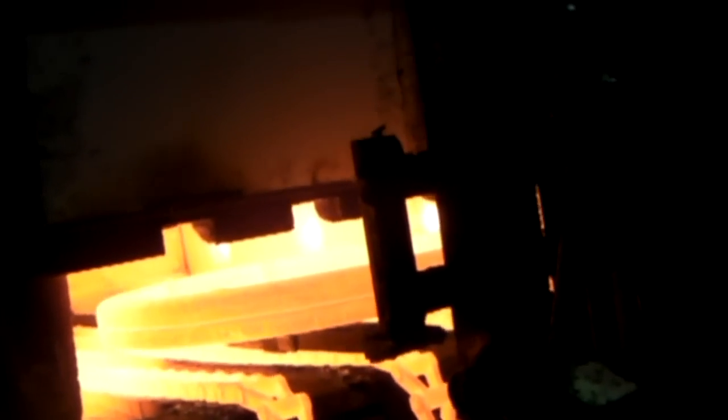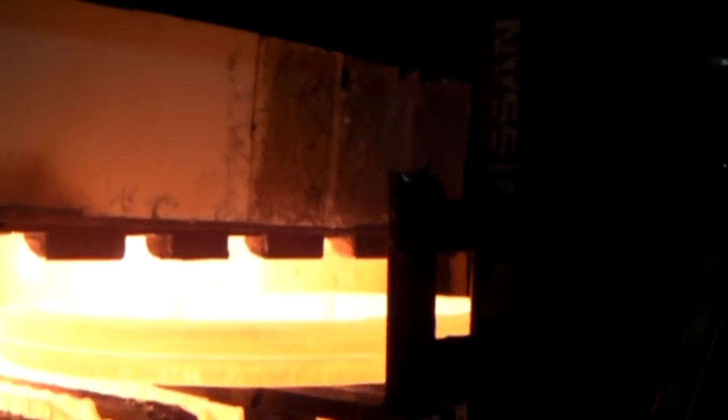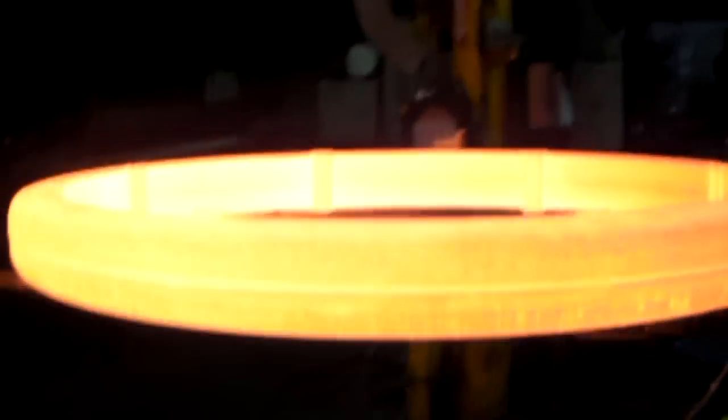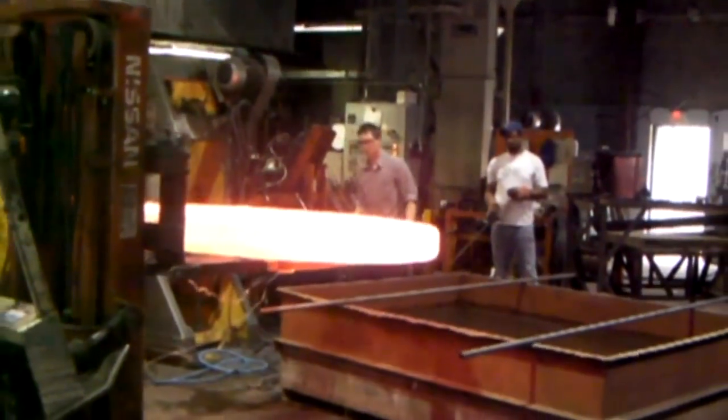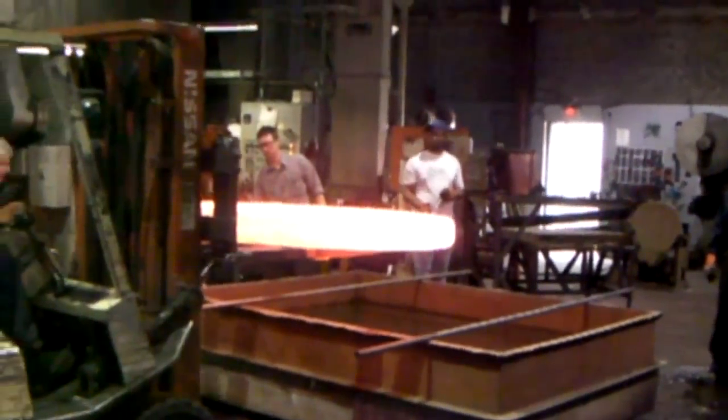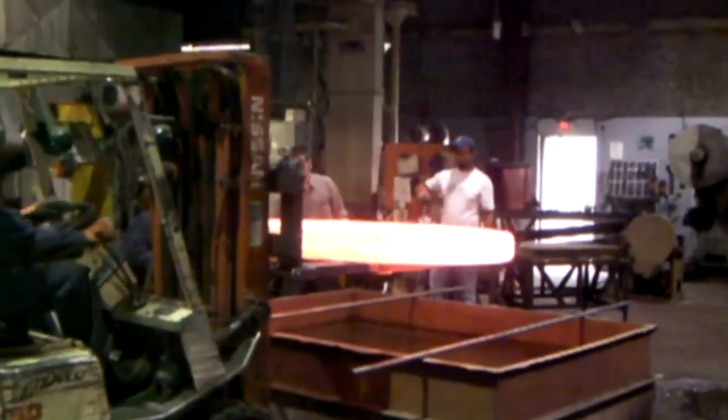In this example, we're performing a 1,950 degree Fahrenheit stress relief and water quench on 304 stainless steel, with the thermocouple attached directly to the part during heating and quenching. The Partlow MRC5000 recorder delivered an accurate graph of the heating and cooling cycle. We've also performed a stress relief and air cool on 347 stainless with great success.